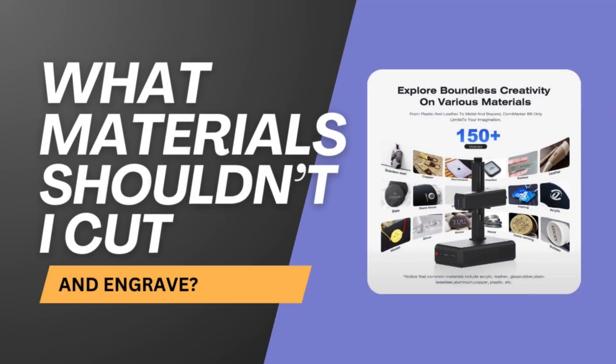What materials shouldn't you engrave with a fiber laser? While fiber lasers are powerful and versatile, there are materials they cannot or should not cut, such as wood. Fiber lasers aren't great for cutting wood because they use a wavelength that wood doesn't absorb well, leading to uneven scorched edges. Wood absorbs the wavelength from CO2 lasers much better, making CO2 lasers the go-to choice for smooth, clean cuts. Diode lasers can also work for cutting wood, especially thinner materials, though they're slower and may struggle with thicker wood. You should also never cut PVC or vinyl with a laser, as it releases toxic chlorine gas, which can be hazardous to both the user and the machine. It's best to avoid these materials entirely.